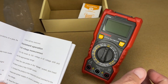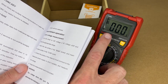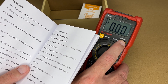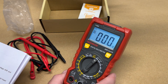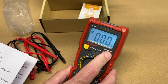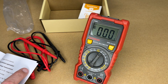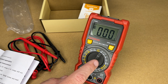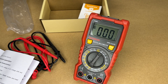The function key puts the meter into data hold mode — if you take a measurement you can hold the reading on screen. If you press and hold for two seconds, it turns on the backlight. You can see the backlight here; if you're in the dark, you'd be able to see the screen clearly. This meter will automatically shut down after 15 minutes if there's no operation, which helps preserve the batteries. If you turn it on while holding down the function button, it will disable that auto-shutdown — useful if you need to monitor voltage for more than 15 minutes, such as recording with your phone.